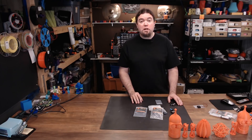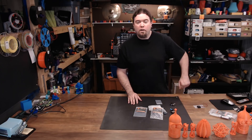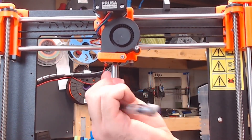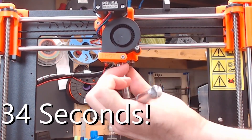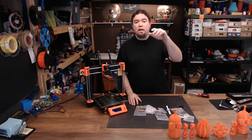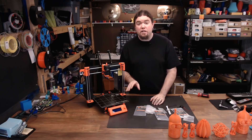Although hassle-free parts on your 3D printer is worth a lot. And that brings me to my favorite part about the Mosquito hot end: one hand behind your back. Are you the type of person that likes to try different size nozzles? Well, then the Mosquito hot end is for you, because hot or cold, you can switch it out with just one hand. And if you've ever had to swap out a nozzle while holding the heat block with a set of pliers, trying to avoid the thermistor and the heater wires, backing out the nozzle while everything is extremely hot — then you'll know exactly how much that feature can be worth.